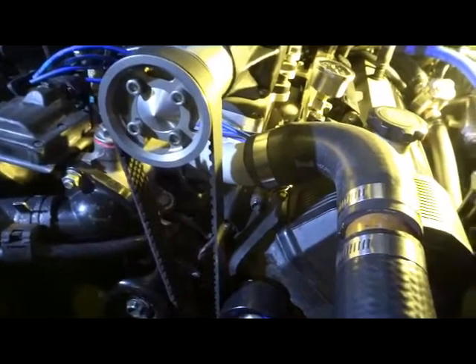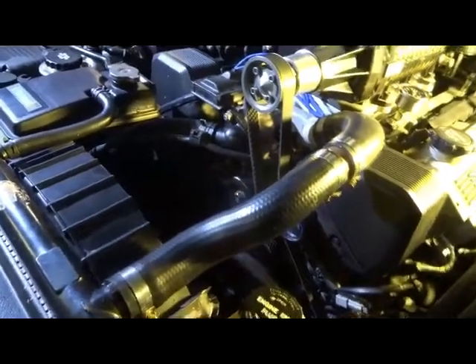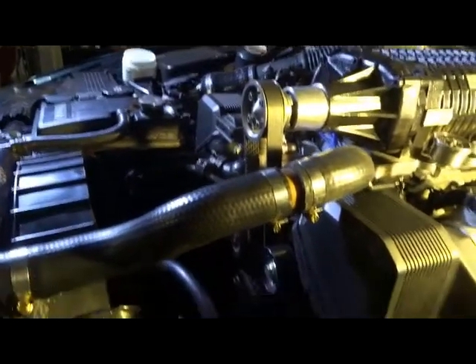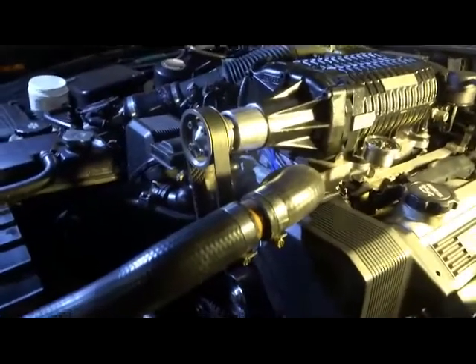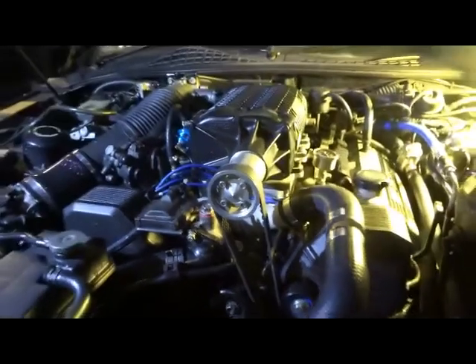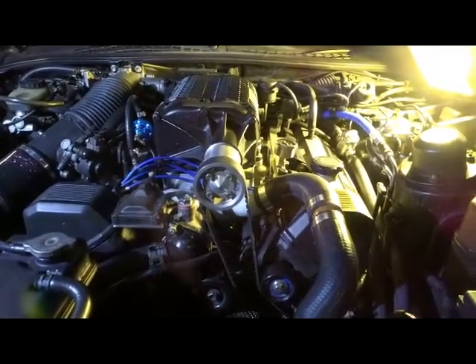Running the hoses across here: join one of the old hoses, the supplied piece of hose comes down into there. It's pretty high — that's going to be the highest part of the motor now, so that's where you're going to have to bleed the radiator, because there's going to be air wanting to sit in this high part here. That's a bit of a nuisance, but at least now, if I have to change a belt, adjust a belt, or change a pulley and belt, I don't have to drop all the water and that sort of stuff. I can just remove the belt without having to drop all the radiator coolant.